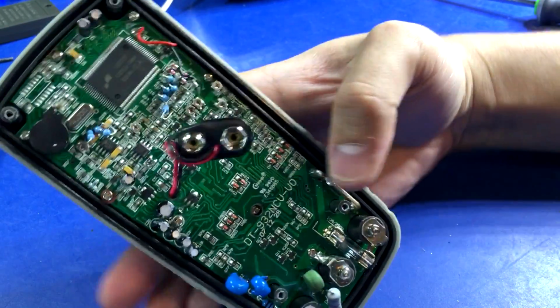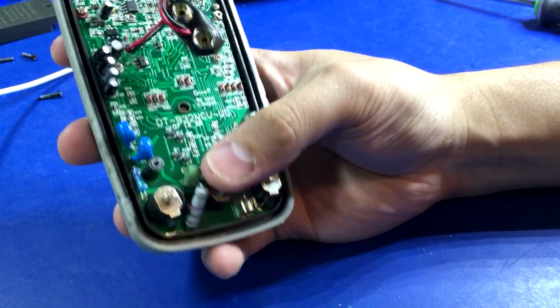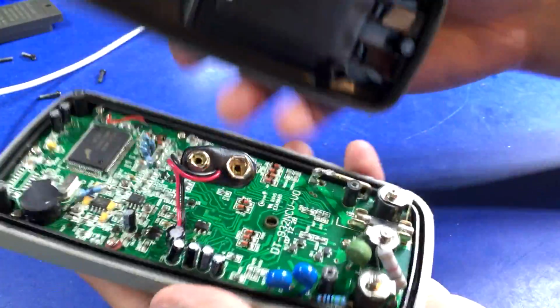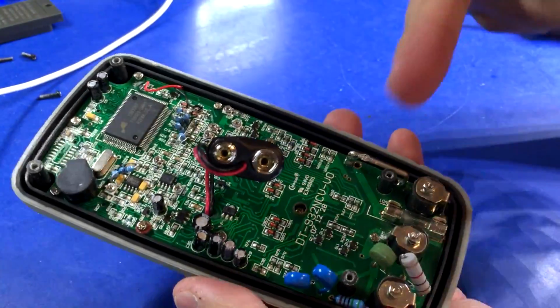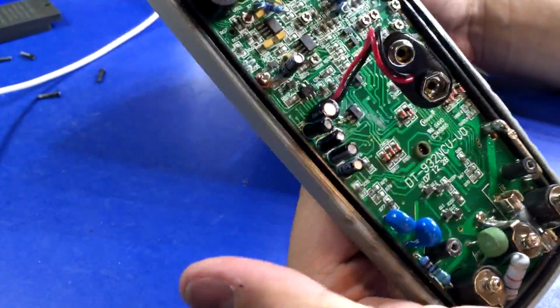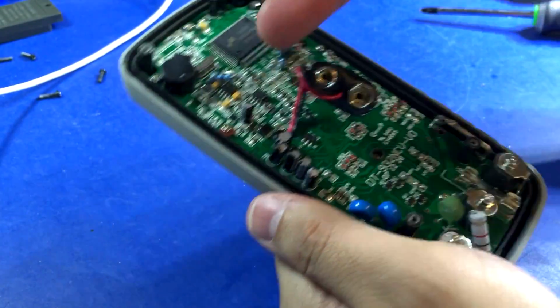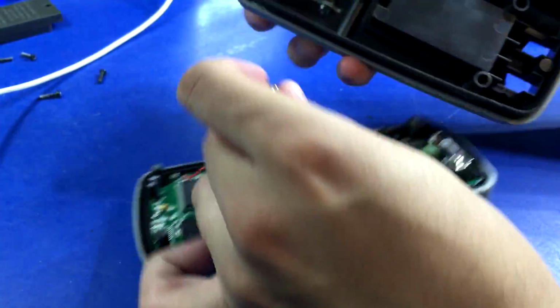Yeah, that's fine. The fusing is just unacceptable, but at least it's got solid tube type input jacks, and it does have decent blast protection. So yeah, not great. No shielding. Could use ceramic fuses. Could use a fuse for the milliamp range, but it's okay. I'm just surprised they used this many through-hole components, but can't get everything you want.